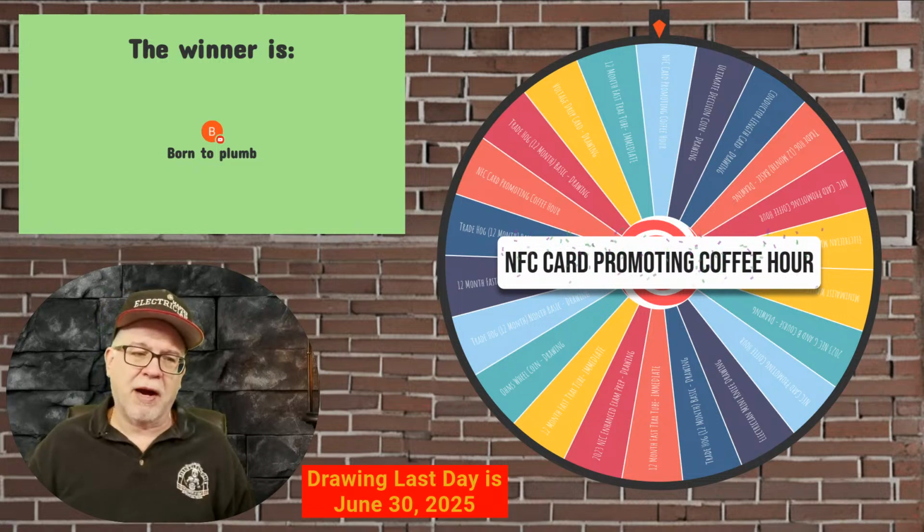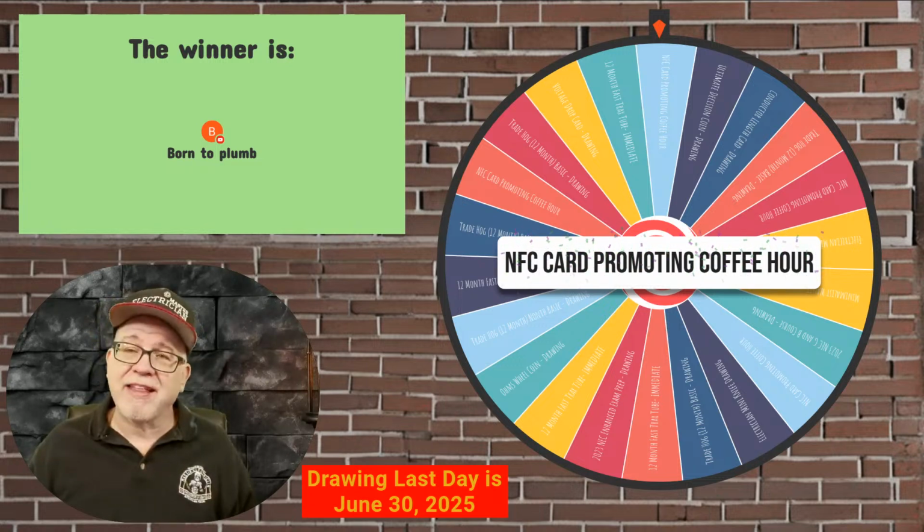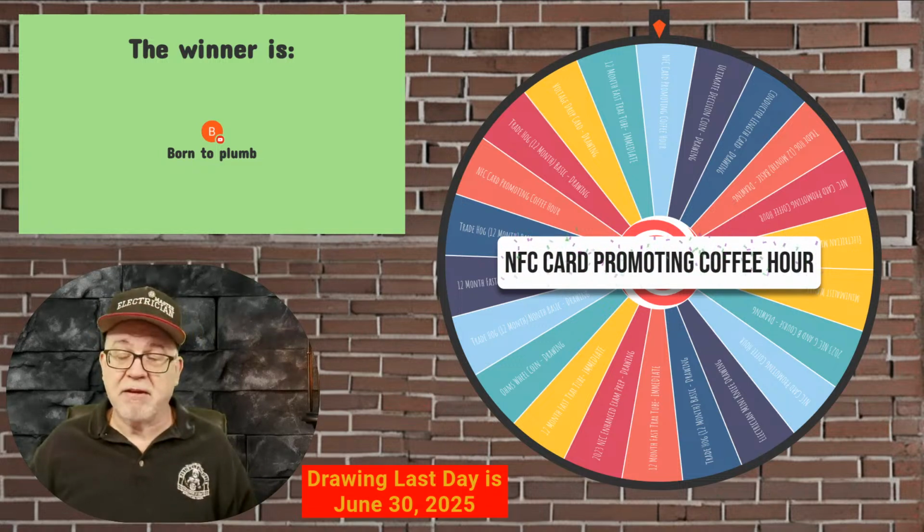I also work for Prysmian Encore Wire, so obviously I would not promote a manufacturer of other products, right? PVC is the predominant used insulation type in most building wiring. Although there is a thermoset, like a cross-linked polyethylene, that is probably more resilient, with better dielectric constant properties, has less leakage current. It's better to resist chemicals. It's a cross-linked polymer that is more resilient to abrasion. All of that is going to be better than a PVC. Is a PVC still okay for use? Yeah, sure. THHN, THWN-2, PVC installations, great. PVC is used, for example, in PVC raceways, perfectly fine. No problem with those type of things. So I'm not sure of the question, okay?